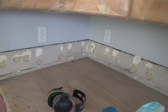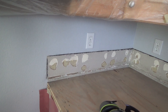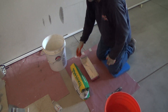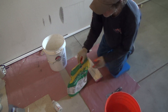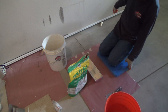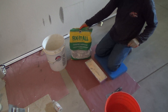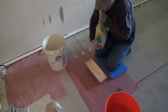The masking tape isn't going to pull up because there's so much mud around the outside to keep it straight and float it off. I'm going to put two coats of Fix-it-all on there and that stuff dries hard as a rock. Sometimes you just gotta use what you've got. Here's my patching compound — I usually use a quick set material, but this is called Fix-it-all. It comes in a dry condition in a bag and you can store it for a long time.